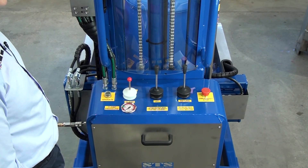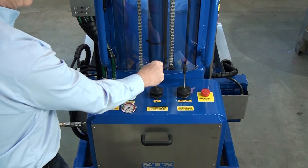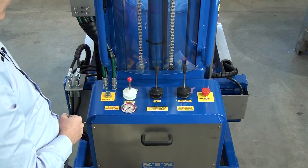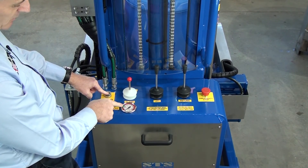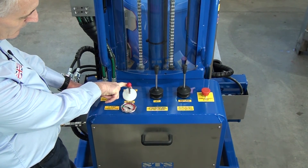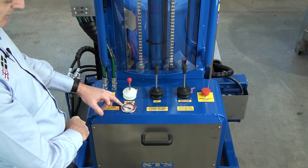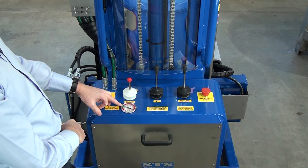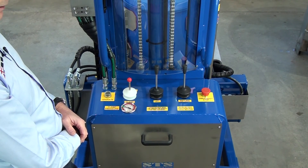This is the control panel of the unit. First thing to notice is the emergency stop — press this down and we have no power to the unit. Turn so it pops up and we have power. To clamp the drum, press operate and watch this needle while pulling this back. The needle will settle into the green — initially it will go into the red and come back to green. Before lifting the drum, look at the drum to make sure it's clamped properly and check the needle stays in the green, which shows you have enough clamp pressure to hold the drum.